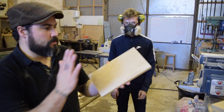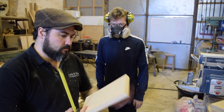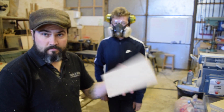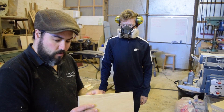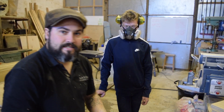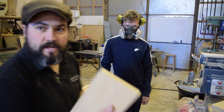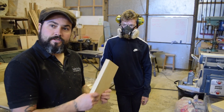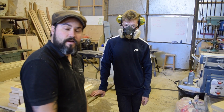We've got 10 blanks now for the herb chopping boards for the garlic farm — a really good customer of ours. These are usually 130 millimetres wide but these are 140, so a little bit bigger, 260 long, and also a little bit thicker than usual. When milling them up we got to a stage where we had a completely flat board at 24 mil thick instead of milling down to 22 mil — much better. Now I'm going to take these over to the router to give them a chamfer, then Bailey's going to sand them up and they'll be ready for laser engraving and finishing.